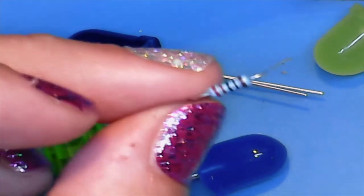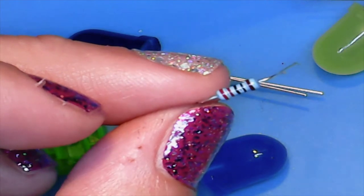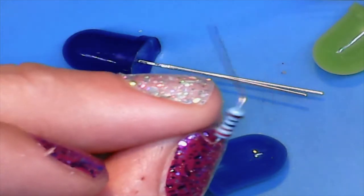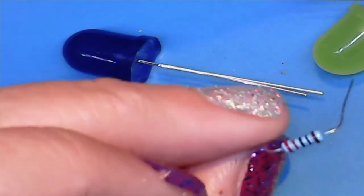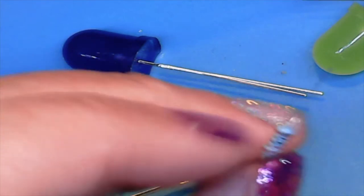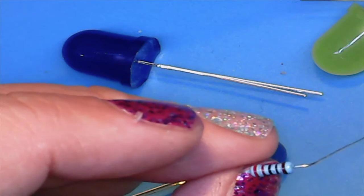And so this is a 220 ohm resistor. This is a 5 band, so it's supposed to be red, red, brown, brown, black, I think, the light's bad in here, or my vision's going bad and it's something else. Either way, 220 ohms, they should have been marked in your kit. I don't have a beige 4-band handy, otherwise I'd show you what that looks like as well.